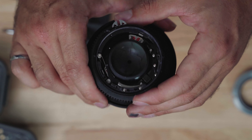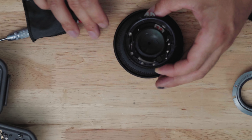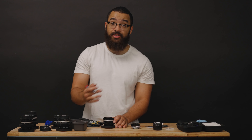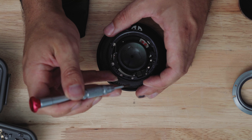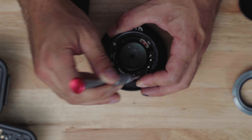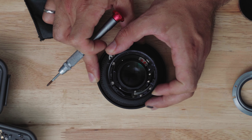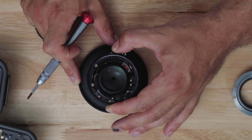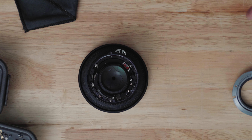I'm going to do the same cleaning on the internals of the aperture ring, then apply the lens grease. You want to be generous with the amount of grease but not so much that it overflows and gets into the internals. I'm putting a healthy amount, then wiping off any excess. Putting the aperture ring back, it's not fully seated yet — that's because of the internal mechanism. I'll use the screwdriver to position things forward, seat the aperture ring, and now the pin freely interacts with the aperture ring, giving a smooth open and close of the aperture.